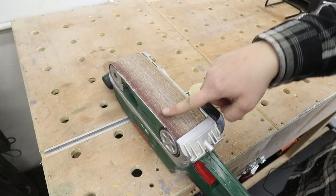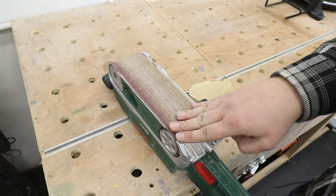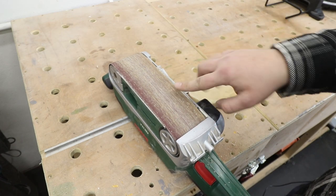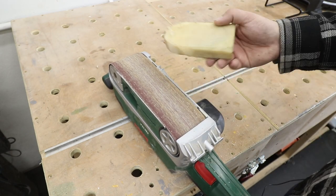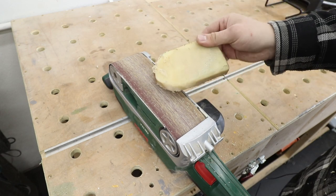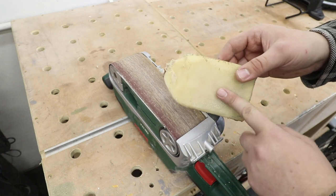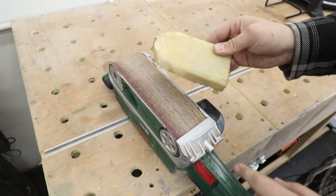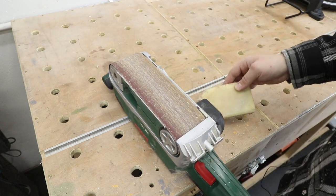As you can see, the belt got really dirty and clogged up with residue from the rough-sawn wood. To keep the belt in the best possible operation you can get one of these — it's a clearing block for sandpaper, it costs pennies. I've got a whole video about this and I'll drop a link in the description below, but have a look at how easily we can clean this belt out.